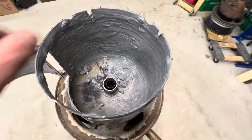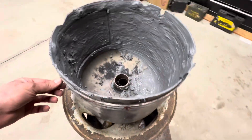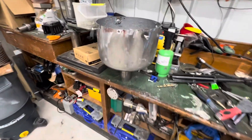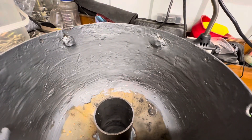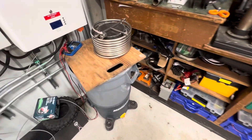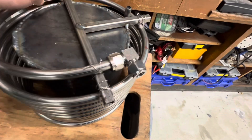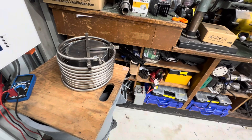I did get the lower half done — it's going to take a little bit of cleanup once it dries, but that should not be an issue. I got the door coated as well, so hopefully that will retain a little more heat and direct it towards our heat exchanger. This is the top of the combustion chamber and it looks pretty good — I used my hand to spread out the cement so it has a nice even coat. I also took a couple of minutes to attach the heat exchanger to the little pot using some stainless steel wire, wrapped around a bunch of times, so it is fairly secure.